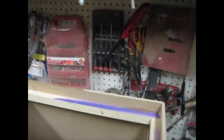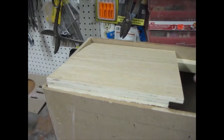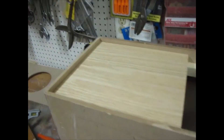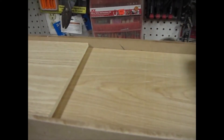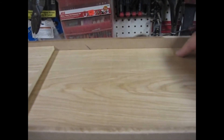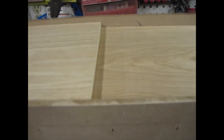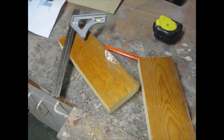I skipped a couple of steps, so I'm going to try to catch up. This is a piece of 5 and 1/8 inch oak that I had, and you can see I hollowed it out in the back. This is going to be where the buttons are mounted, and I'm going to have a grill plate. There's going to be a grill cloth over here — it's going to have a Radiation King crown and words, and behind it it's going to be cut out with speakers mounted there. As you can see, it slides right in. I left some gaps because it's going to be wrapped with cloth, which will make it a little wider. Over here I'm cutting some legs, and I'll do that next.